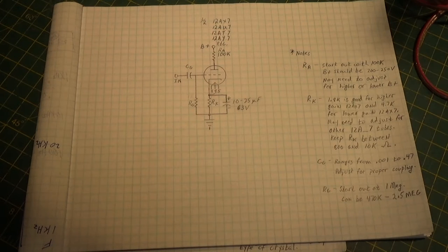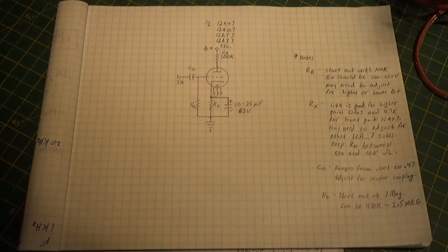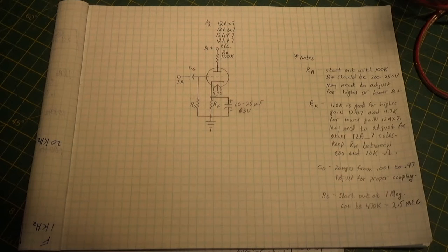But the output just isn't enough to drive a tube circuit. There's a whole myriad of reasons - voltage, current, all these things - but the bottom line is it's not enough to drive your amp to full power in most cases. Some preamps are a little more sensitive than others. I showed you that I was able to use the preamp out of one of my Pioneer integrated amplifiers to drive my tube amp to full power, but that had a lot more output - it boosted the signal considerably from what the MP3 player can put out by itself. So what if we don't want to use a preamp? Well, this is kind of my solution.